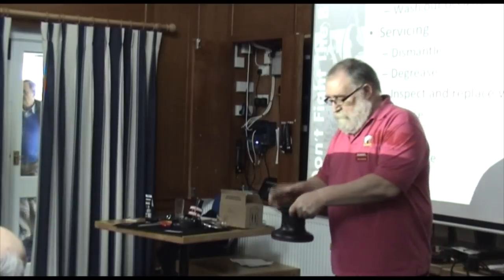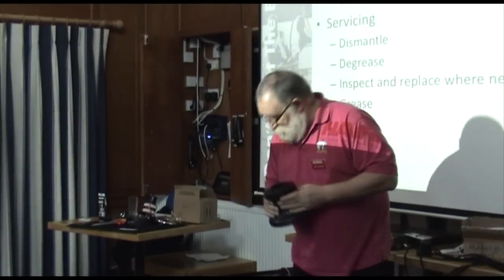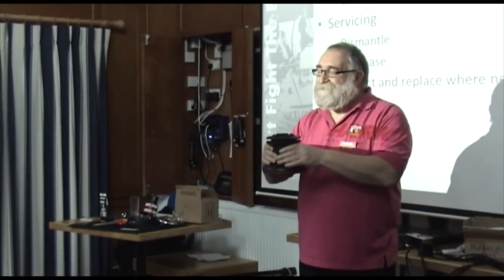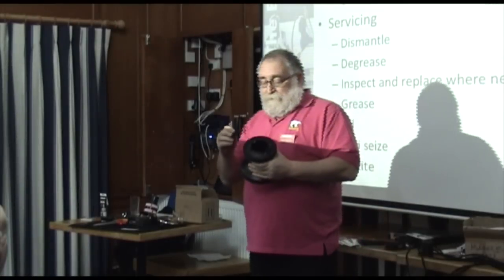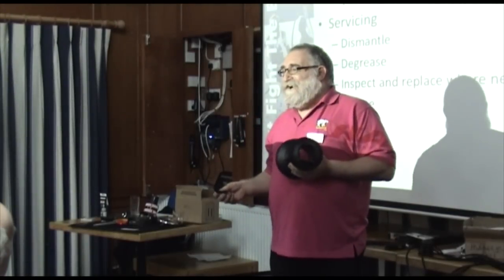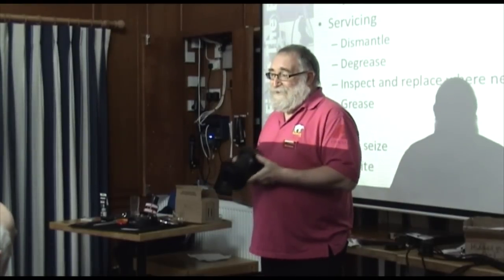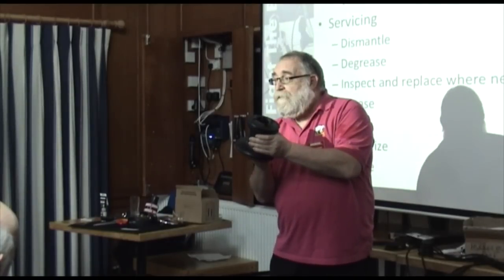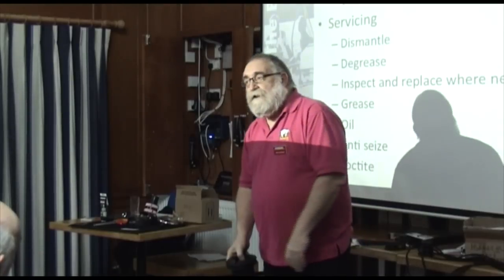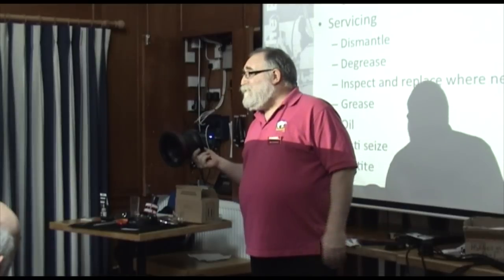You lift up the drum. Now at this point, you can see into the drum. There's a big hole at the top of the winch. That actually only falls out because this winch has been taken apart 57,000 times. Because it's got no grease in it as well, which means when I come to reassemble it, it's really hard work. But you can see, are the bearings caught inside the drum? Because if you don't look and you just lift it off, I guarantee they're stuck inside the drum, but they're not very stuck inside the drum.